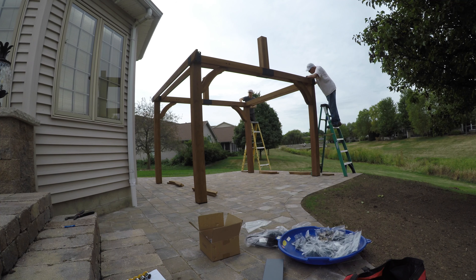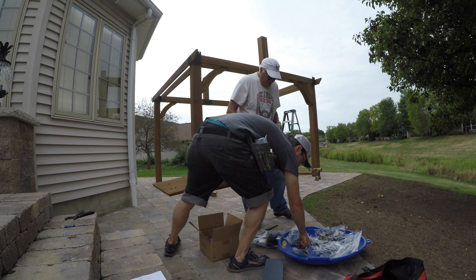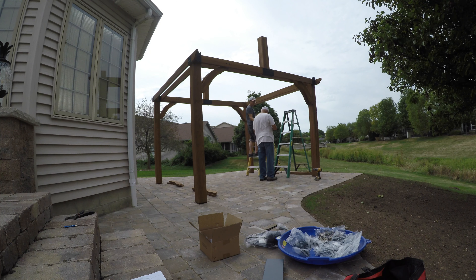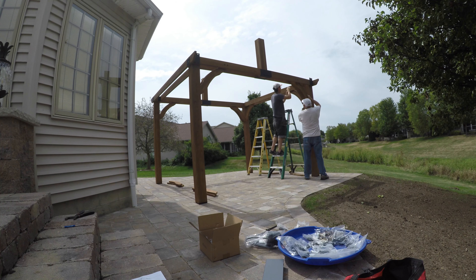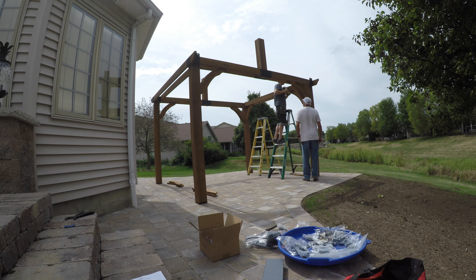You'll see that several times we're working two ladders. You could have done this solo with a lot of clamps and straps, but it's nice not to have to do those kinds of balancing acts. The first thing we're doing here is squaring up the structure and making it more rigid. It was wibbly-wobbly, but once you get some triangles in place — some triangular angular bracing — a structure like this will just stiffen up. When we lock this in, we alter the shape just a little bit, get it square and lock it in place.